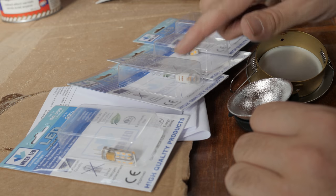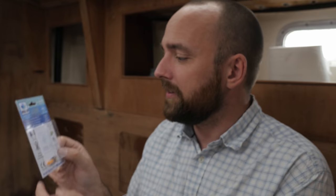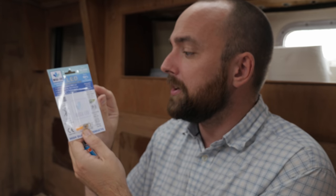I'm hoping one of these LED lights will fit inside this light fixture and produce good quality light without any flickering. I have no idea if these LEDs are dimmable with a pulse width modulating dimmer, or if that's always going to cause that annoying flickering. It says right here on the packaging that these are dimmable with the majority of dimmers — which tells me absolutely nothing. But I'll find out. And while I'm at it, I'll compare the light from the LEDs to the light from a good old-fashioned halogen bulb, which should give me a good indication of color temperature. All of that is going to be its own separate video — stay tuned.